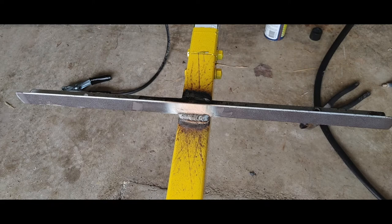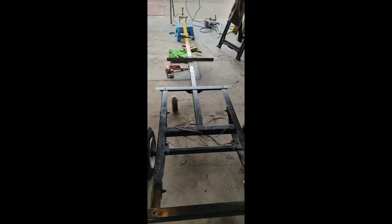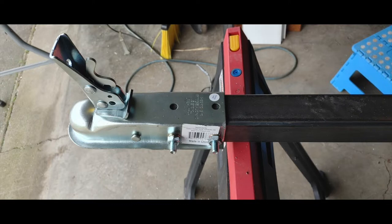I'm going to mount three wood rails sideways across the frame to hold the PVC tubes. I'm using the front and rear rail that's already on the trailer, but I had to add another rail further up the tongue, just beyond where I added it on. Here you can see I've welded it in place — a piece of old steel angle from a bed frame that holds the box spring and mattress. I had that laying around; it was free and it works great. Here's a picture from the rear of the trailer showing the frame along with the new rail I added up closer to the front. Another picture of the hitch before I cut the bolts to length and painted it all.